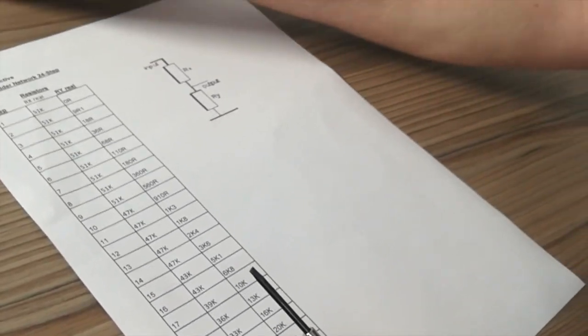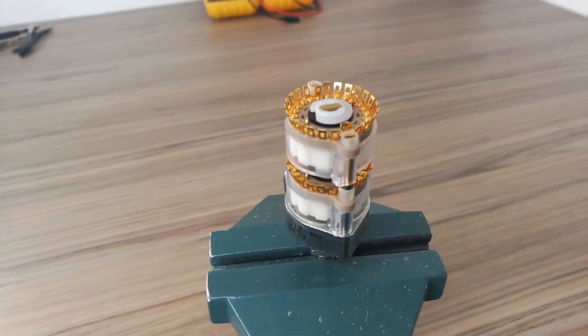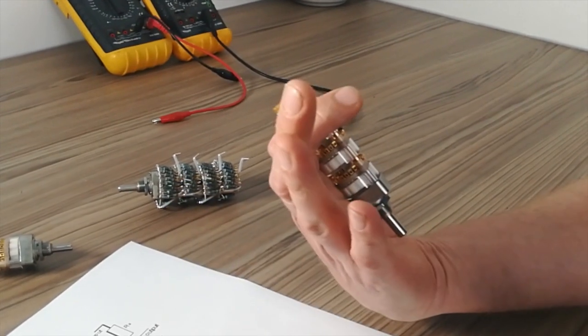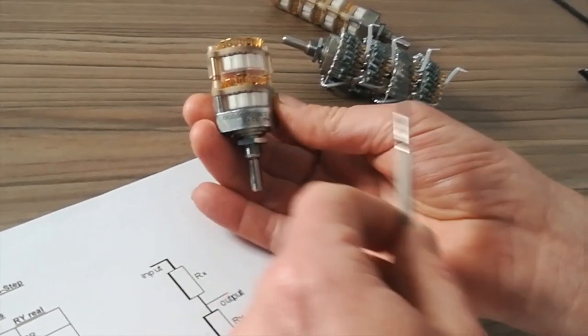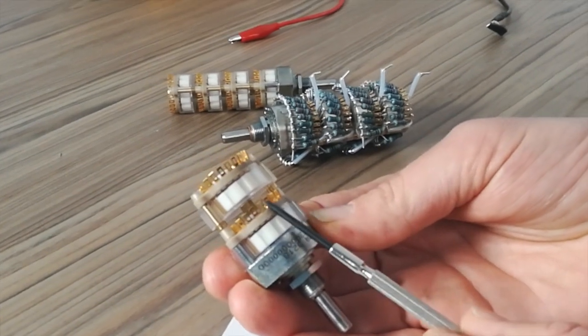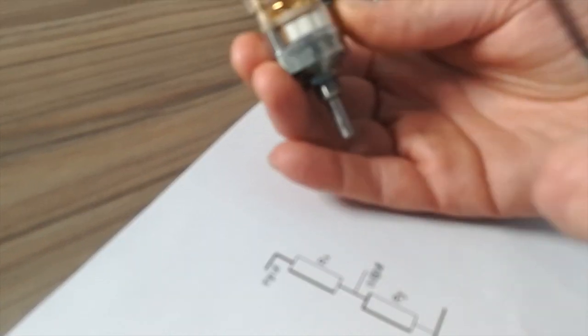24-way switch. So you could obviously have a mono where you'd use this one, which is a two-pole 24-way. That's for a mono ladder. And this one is for a stereo ladder. So for the purpose of today, we'll basically talk about building a mono one, because effectively, you're just repeating that to make a stereo one. So the way we build it is, there's two wafers here. So this first layer, this first wafer, we will build the bank of RY resistors like this.